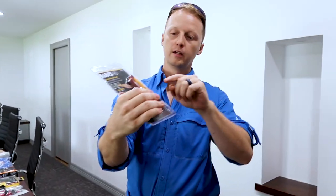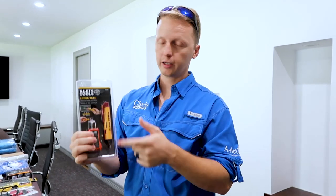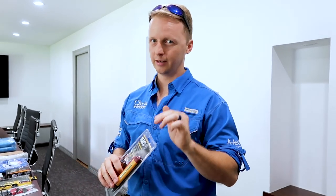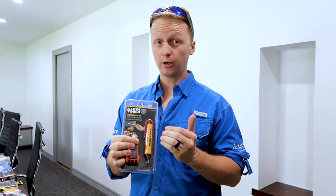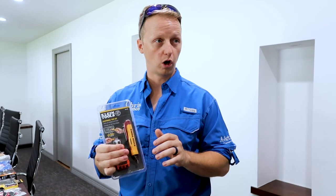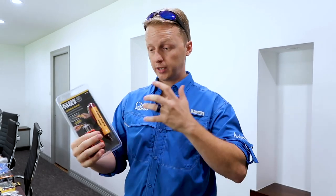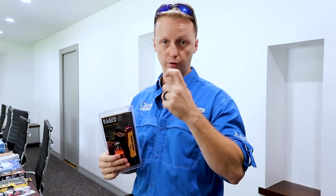The voltage sniffer — really important. It tells you if a wire is live or not. I recommend checking out Reuben Saltzman on YouTube; he has a really good video on how to use a voltage sniffer and how they aren't always perfectly accurate, but they can still keep you out of trouble — especially in a crawl space. I like to carry it in a crawl space and leave it on, because sometimes the ground can be charged while you're walking. If the ground is charged, this will light up and you need to get out.